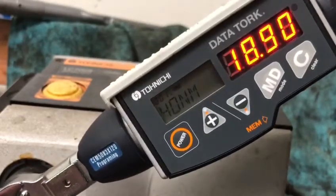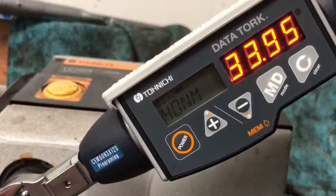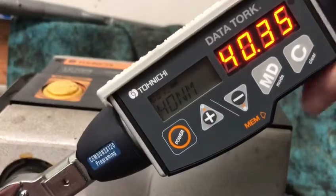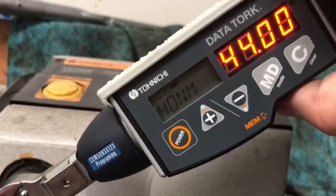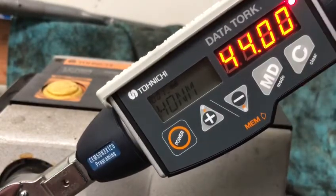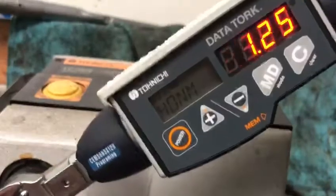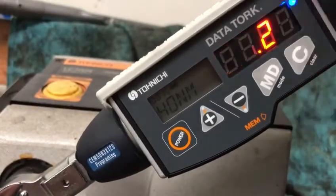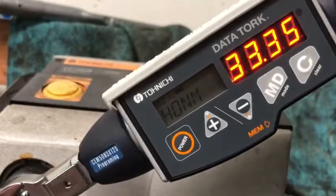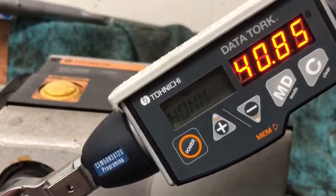Now we're going to 40Nm, so this would be the M12 I think it was. I'll go over again — that's 10%. I have to rework that. So we will see that I've done this a total of 5 times to complete the 4-bolt tightening sequences properly.